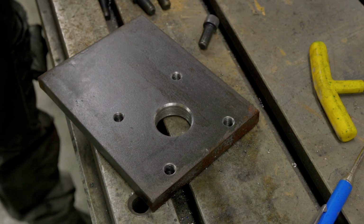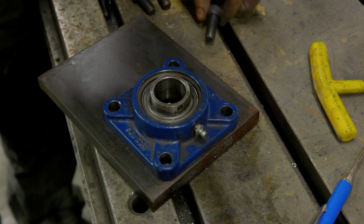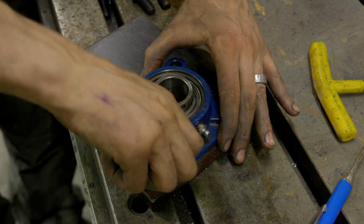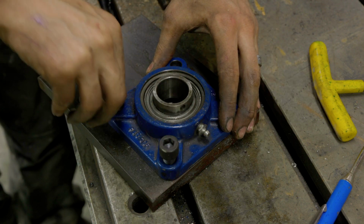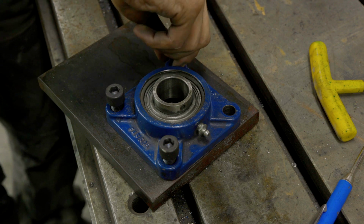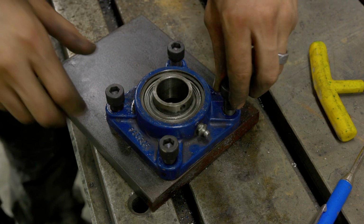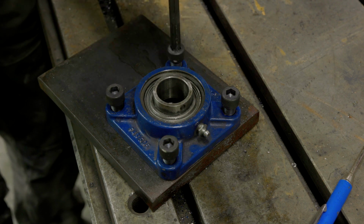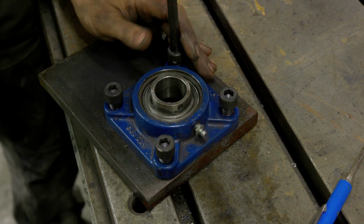Got this plate jammed out. Obviously I need an annular cutter of the right size. That would have been more efficient for the center hole, but we got it done. Went with 1.5 inches, so we had plenty of clearance for the 1.25 bar.